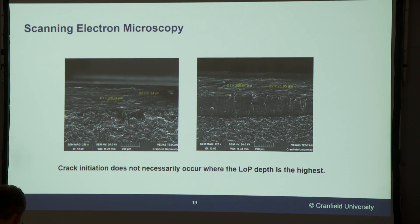Something particularly interesting about the results with defects is that we were expecting cracks to initiate where the defect depth was highest — since the defect runs throughout the weld — but this is not what we observed using scanning electron microscopy. It seems somewhat random in terms of depth, so we're trying to analyze whether there is any influence of aspects like the shape factor of the crack, and maybe that's what's influencing initiation. This is work I'll be pursuing in the future.